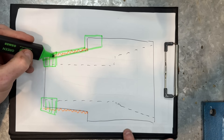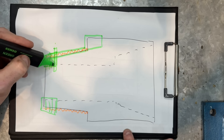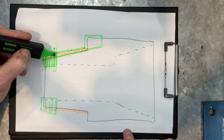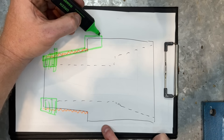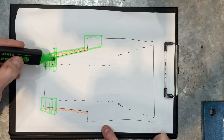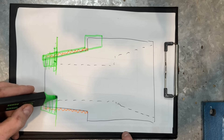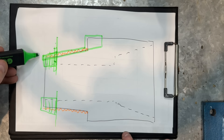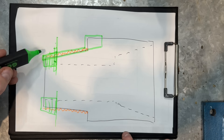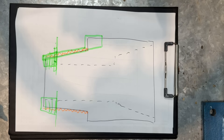I don't need to go all the way because I can then chase that thread — what is left of it. So rather than having to recut the whole thing again, it's just making a program to take off the little nose section here. I could use either a parting tool, which is no problem at all, or just do lots of facing, and we'll see how the parting tool goes. Sometimes when it is actually threaded it's not ideal. I can't cut this in the saw because the saw is not large enough to grab it correctly, so it's just quicker to put it into the lathe and get that measurement accurately. Once the nose is taken off and I've brought it back to metal, it's going to be a matter of using my z-axis adjustments to recut and chase the thread, and it should come up absolutely brand new. So that's what we're going to do in the CNC today.